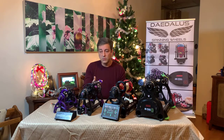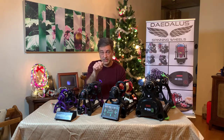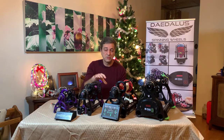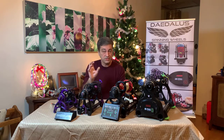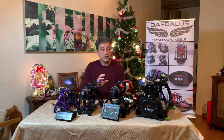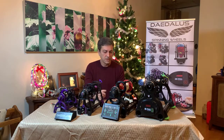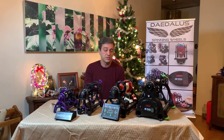So with an electric spinning wheel, some of them have knobs that you turn 1, 2, 3, 4 up to 10, and you got to remember, well, I'm a 3.5 or a little bit in there. Well, I went a step further, and I use digital speed controls that give you between 0 and 100% adjustment. So if you go to a 67% speed, 6 months down the road, you bring it back to 67, it's running that same speed as it did. So the consistency to be able to repeat those projects is fabulous with electronic speed control.